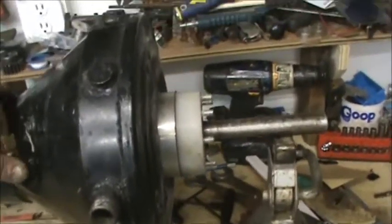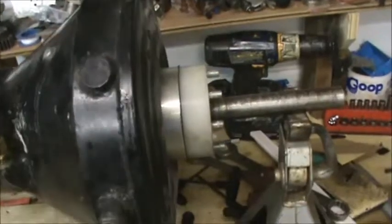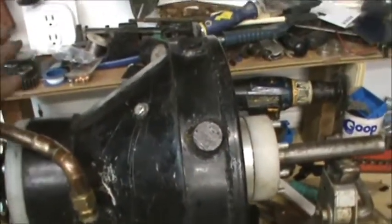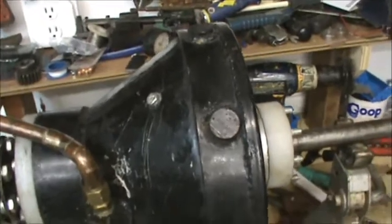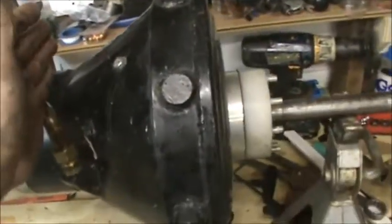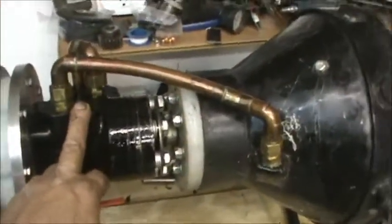Once rotation occurs, there's an accumulator between the hydrostatic motor and the gear pump. Think of it as an inverse piston — instead of pushing, it actually pulls down and creates a huge vacuum, which causes the fluid to act like a ram piston that shoots straight up to make up the difference. Because once that pressure is unequal, the fluid wants to move forward, causing the hydrostatic motor to accelerate.